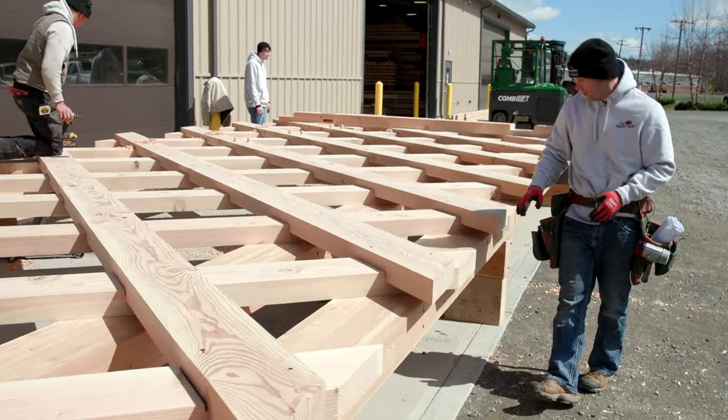Every one of the rigs is picking the same amount of weight due to the fact that the cables can pivot back and forth. So all 4 ropes are going to counteract each other, but you still want to be able to steer that thing if you have to. So we're going to have 2 guys on a rope, 4 ropes out, 2 to get thrown across, and this thing's going to go just the way we planned it. So let's do it. All right, fellas, let's hit it.